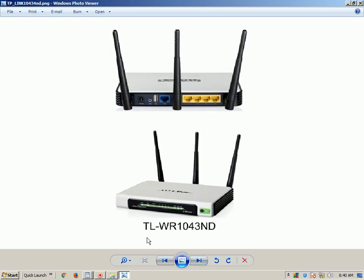Okay, now this right here is the TP-Link WR743ND. If you can find a couple of old ones, this has 8 megabytes of memory on it, where you can put LuCI, Batman, everything you want on it, and it's Atheros based. Don't get the 1.8 version. They got a Wi-Fi bug. But if you like 1.10s, 1.11s, 1.9s, 1.7, anything but a 1.8. If you put Barrier Breaker or Chaos Calmer on there with the updated drivers, these are rock solid awesome. These got 8 megabytes. I got quite a few of these. I was going to use these, but I decided to go with the D-Links.